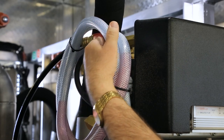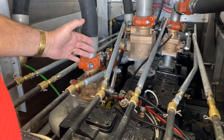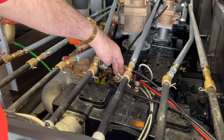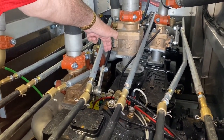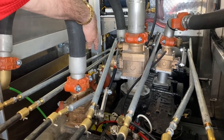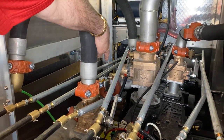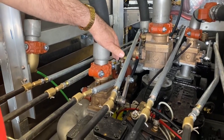On the driver's side of the pump panel looking inside the pump house, there is the pressure sensor for the discharge. Over here is the strainer for the heat exchanger — that needs to be checked periodically to make sure it is clear. Further down below is another sensor, the intake sensor. Further over on the manifold going across the front of the pump is the foam manifold, where the foam injection system is located. There's also a flow meter there to determine how much concentrate is supposed to be injected based on the input on the gauge.